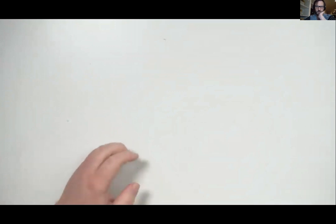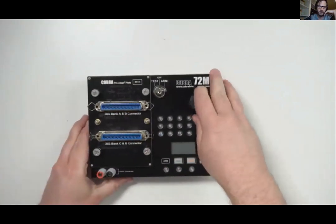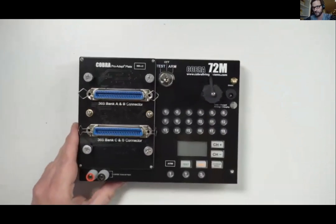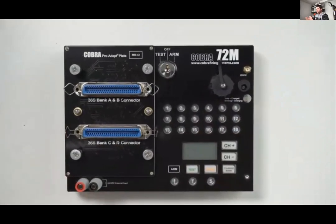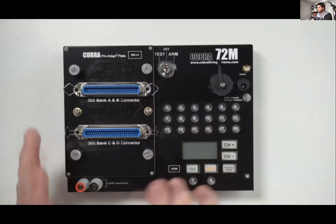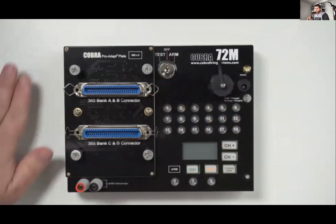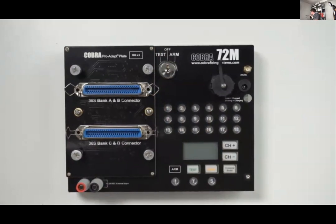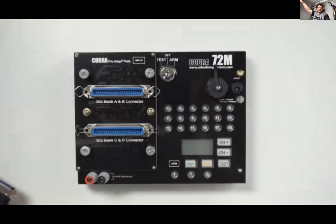All the pin-outs are the same, making it a completely modular design. The 72M no case, no nothing, just with the pro adapt plate — it has two Centronics 50-pin connectors. This is a good opportunity to showcase our Centronics 50 to RJ45 slat cable — a new product not yet released on the website, which connects the Centronics 50-pin cable to six RJ45s, more commonly known as cat five or cat six connections.